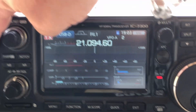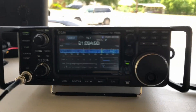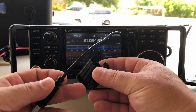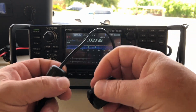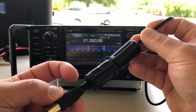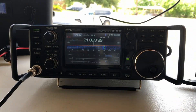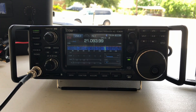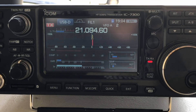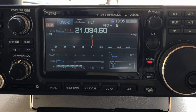See the TX is still lit? I'm going to push the transmit button to turn that off, because it's having a hissy fit with all the RFI coming through that cable. We can sometimes fix that by putting a couple or a few — depending on how many you need — Mix 31 ferrite chokes right at the radio. That's where you want them: at the radio. Plug it back in, band switches are good, hit the tune button, and now you can see we've got power out, because we've eliminated that RF coming back on the USB plug.